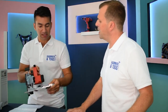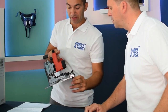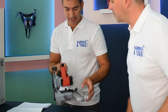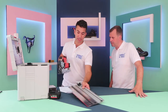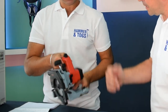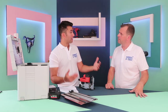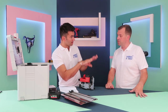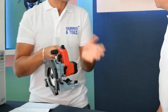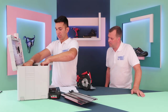It's a spring-loaded rail system — you can do mitres on it. I can set this to 45 degrees, lean it against something, turn it in, and it gives me a perfect 45-degree cut straight through the board. You can then take the saw off that system and use it as a plunge saw — it can cut through skirting, just drop straight down. Lay it on its side and it can go all the way around your room, cutting off the bottom edge of the skirting if you're laying laminate flooring. You don't need to take the skirting board off — it just takes 13mm off. It does all the angles both ways.